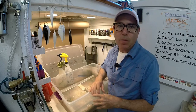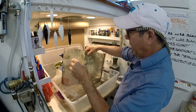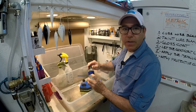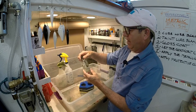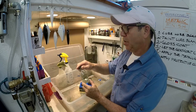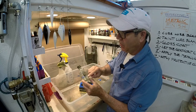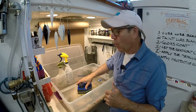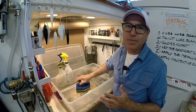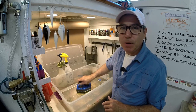Let me show you what comes in the kit. This big container I put together so I could have a coating booth. What comes are these concentrated fluids: you get the R part, which is the reactant, and then you get the A part, which is essentially the silver nitrate or silver solution. The ratios when you mix them with water are usually pretty high — this is 100 to 1. I ordered these from an offshore company — kind of sketchy. They come with very poorly sealed and poorly contained chemicals and you can smell them coming when they leave them in your post box.